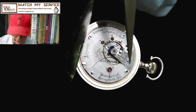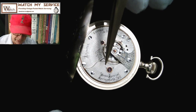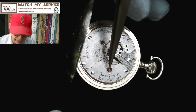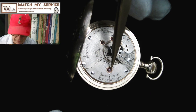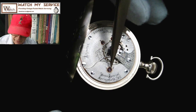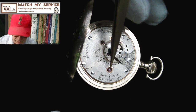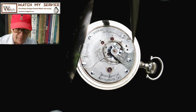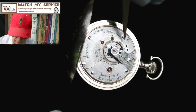A jeweled barrel with a full plate — I don't know if I've ever seen that before. That contributes to one of the 24 jewels; I suspect on the other side there's a jewel as well, so that's two more jewels. This jeweled barrel is in a gold setting. The actual barrel center arbor poking out here is in what I suspect is a 24 karat gold setting, given the high end value of this watch. All of the wheels also have jewels, so all the pivots are riding inside jeweled settings.